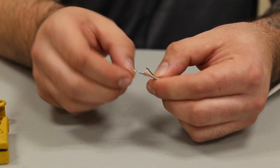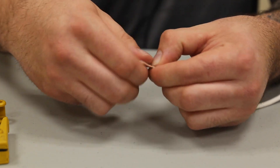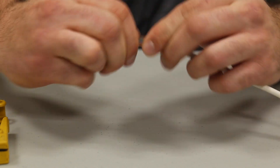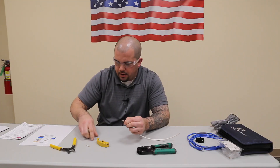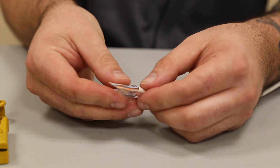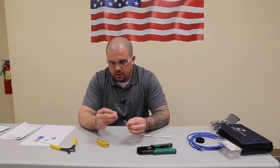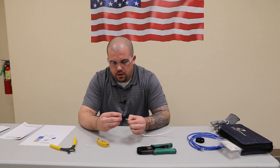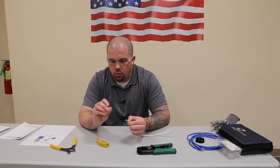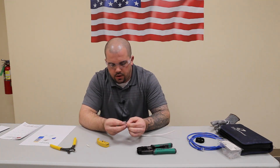Do your best to flatten out the wires and keep them straight. You're going to want to compare it to your RJ45 connector. Make sure that when you crimp this down, the insulation is going to get caught in the first section, which will crimp down and actually hold the connector to the insulation. And you want to make sure that you cut to the length so that there's enough wire to go underneath the gold pins that you're going to be crimping onto the wire.